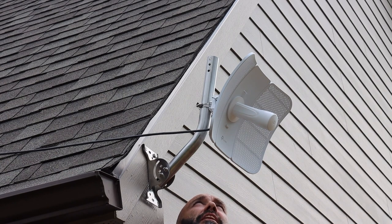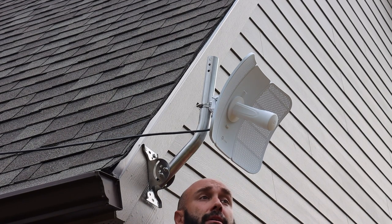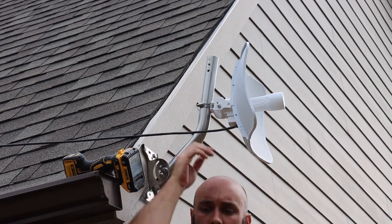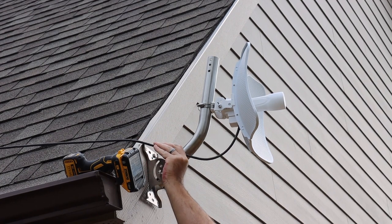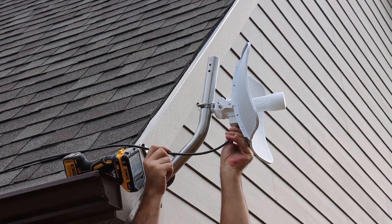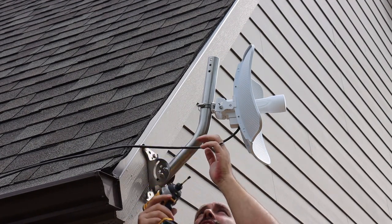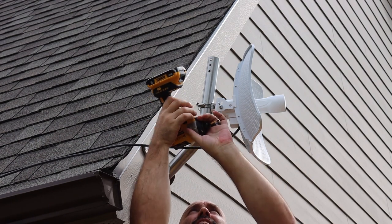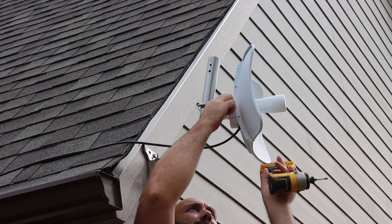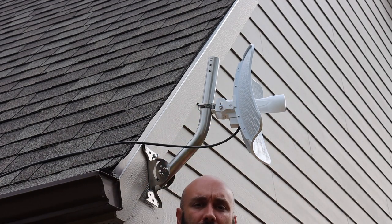We just had to set our angle with the wing nut and set our cable in place underneath the soffit. I can see the cable's already getting taut so I'm going to loosen that up — we don't want any sharp bends or pinch points in our ethernet cable. I've got it approximately pointed where I want it to go, so we're going to go ahead and tighten this down. Once we get into the apps we might be able to see if it's improved by shifting the angle, but it's pretty close so I'll leave it here for now.